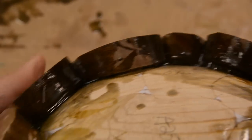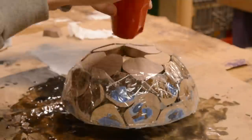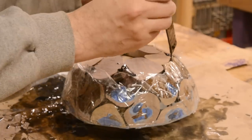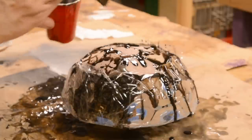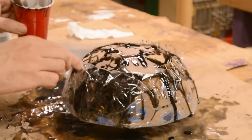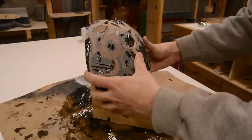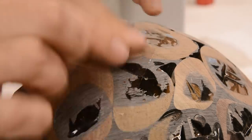From the top you can see it's pretty much filled in up there behind the pieces. So I cut out the rest of the pieces and re-taped the bottom, this time with packing tape, which worked much better. Then I got to a point where the epoxy was starting to get in between the tape and the pieces, so the more I added it was just pushing out the tape more. Again I stopped, let it set up for a few hours, then added more. There were still significant voids, so I made a stand that would support the bowl almost vertically so I could fill in each void and tape over it, which let me address all of the voids in one shot.